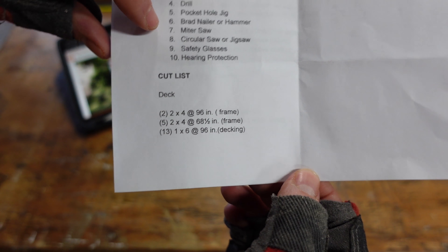We're going to start with the deck and then move through the front panel, the back panel, the side panels, and the roof section as well. As far as the alternatives, the first thing I actually did an alternate on was the 1x6 tongue and groove boards. We actually went with shiplap - they call it a barnwood look, so it's got kind of a rough finish. It's also a 1x6, and here is the tag if that helps anybody trying to find this at Home Depot. As for the other alternates, when they were calling for the 2x4x8s, I actually wanted to do treated lumber underneath the deck area - they don't actually call for that - and I'm also going to do treated deck boards.